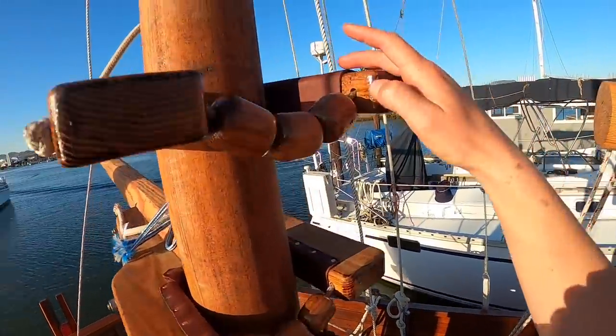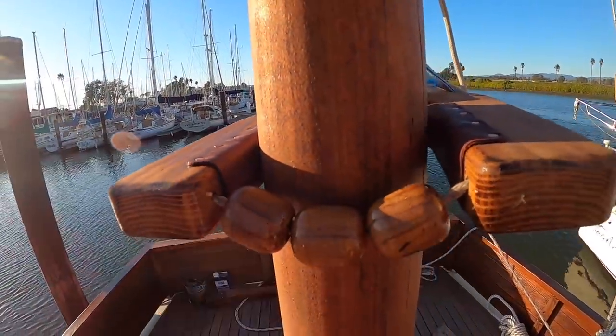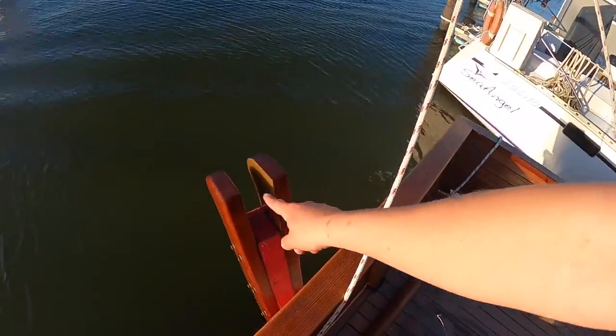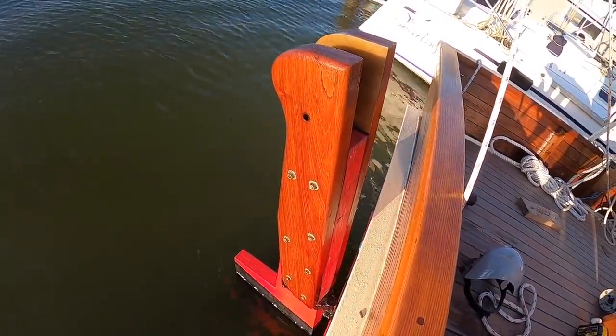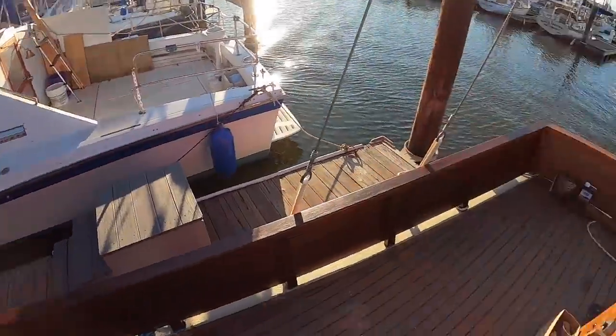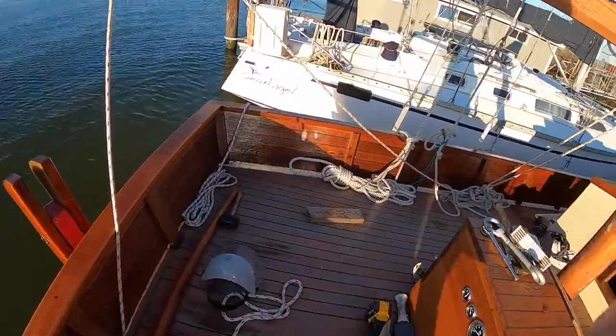Yeah. So Garrett finished the leathering on both the mizzen gaff and the mizzen boom. Wow. So while he was doing that, I got the inside and outside again. Nice hefty coat of soup there on the rudder cheeks. And then I got the inside of the starboard side. I still have the inside here on the transom and the rub rail on the outside of the port side, but that'll be another day. Starting to drop in temperature again, and tomorrow, if I'm lucky enough with the weather, I'll get the last couple steps that Michael did on the port ratlines and maybe re-soup the whole main mast and get Garrett's help to lower down the bowsprit and do that.